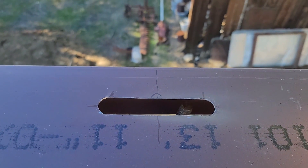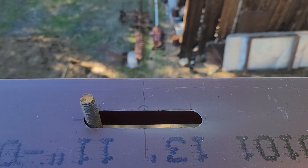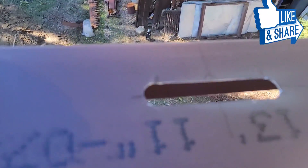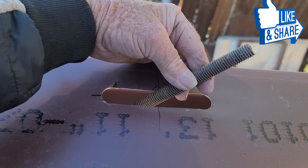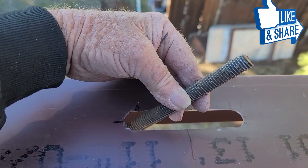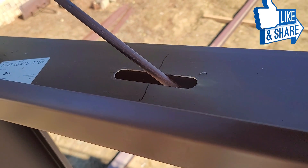So what I do is I drill right where the string line is — that would be the center right here. And I go two inches over here, two inches there. What's also important is the distance from the edge to the center of the hole, which you want offset just like your brace rod hole. See how your brace rod hole is offset? It's not in the middle, it's over here. So you want that to do the same thing — be offset the same. This allows for when the brace rod is going through that you have leeway. So if you have to pull the building a little bit, it can go this way or that way, and it also allows for a little bit of angle too. And that's what it looks like when it's finished.